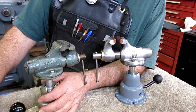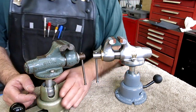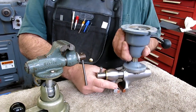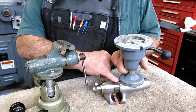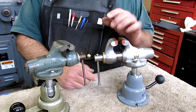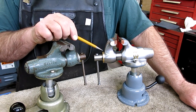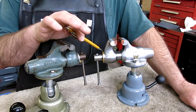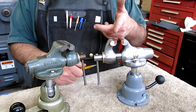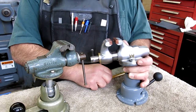I got a ton of comments about the key — keying before welding the jaw on. To me, that was a trivial decision. I just dropped the jaw onto a parallel and instantly it was aligned parallel and perpendicular to the key. It was also easier to position the key after any weld distortion from all the welding. Whatever distortion happened, happened — then I put the key in and it's accurately aligned with the jaw. It lines up pretty good, so we're not stressing over that.